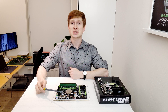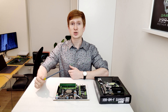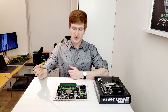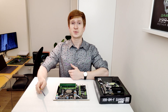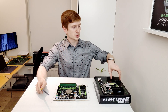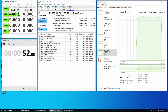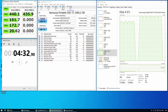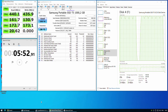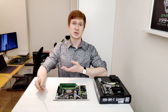Unlike many other cheap Chinese X99 motherboards with a desktop chipset like B85 or H81, the Huananji X99-8MF does not have an external VIA USB 3 controller. The USB 3 ports on the back and front are connected to the B85 chipset itself. And surprisingly, the USB 3 ports are actually working. Testing with my external Samsung T5 SSD drive and running CrystalDiskMark benchmark, the system did not crash. It was hanging a little bit here and there, but the benchmark completed and it took only 6 minutes, which is pretty good. With other malfunctioning motherboards, this benchmark could cause a system crash or could take about 20-30 minutes to complete. So 6 minutes for this motherboard — not that bad — and the system didn't crash. The transfer speeds were slightly lower than expected, but it still works.